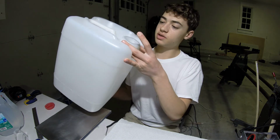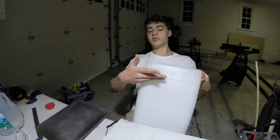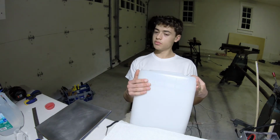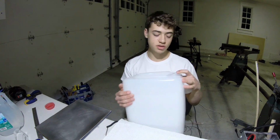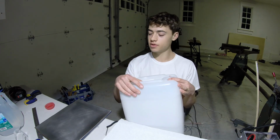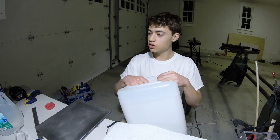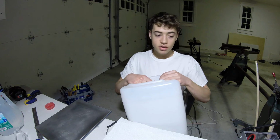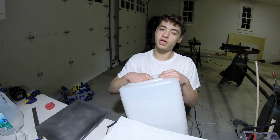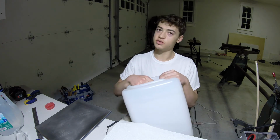Obviously this stuff is gonna leak somewhat, but especially with hydrogen, the hydrogen's gonna be permeating through, probably through this plastic. But in small amounts, real small amounts. And especially if there's not that much pressure difference, it's not bad. Obviously for a vacuum chamber, you don't want any plastic, even copper tubing, since hydrogen will permeate through copper tubing. But if you don't have much H2, hydrogen gas, around, then it doesn't really matter.